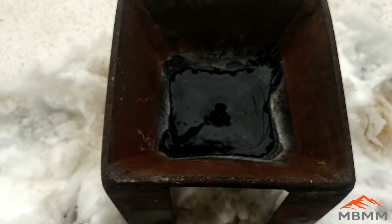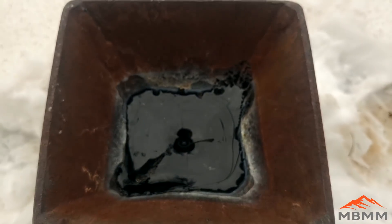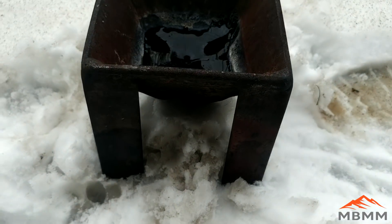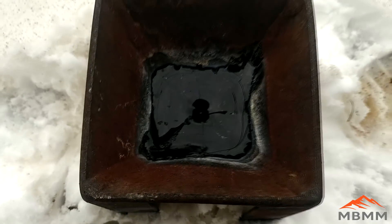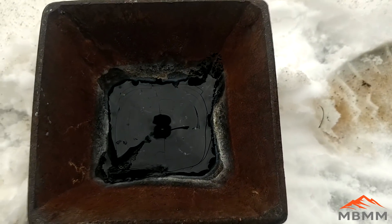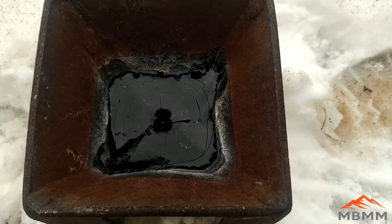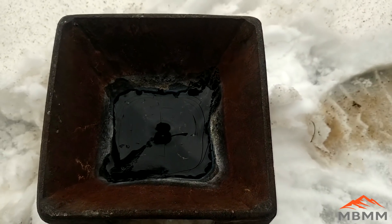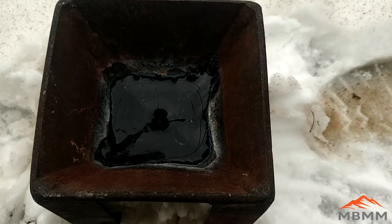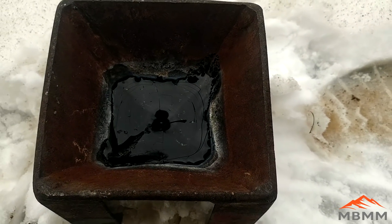Here's our borax charge in the cone mold. It's real glassy and it's pulled in the middle there, which is typical of real acidic or glassy slags. I'm cooling it down in the snow right now because when you use lead as a collector metal, you've got to make sure that it's below the melting point of lead — if you knock it over and the lead's still molten, you get molten lead splashing everywhere. Two things with the cone mold: heat it up and dry it out, but don't get it so hot that the charge fuses to the steel when you pour it. And if you're using lead or some collector metal with a low melting point, make sure it's cool enough that the metal's not molten when you tip it over.